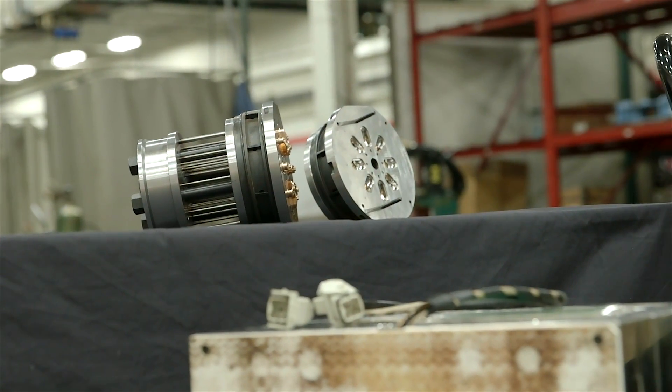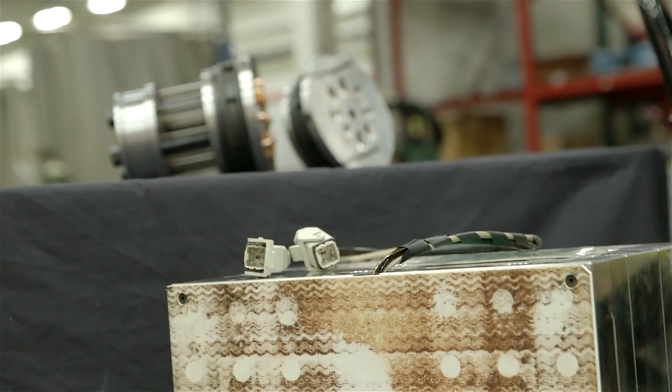You'll also find that savings can be realized in not only quoting but engineering, manufacturing, and molding, as we'll later see in a video that demonstrates the change-out times of the Roundmate system in the molding machine. During the quoting stages you'll find it's much easier to quote a mold that is simply the cavity detail versus the entire master frame.